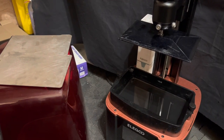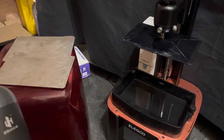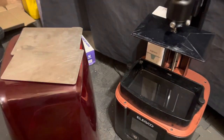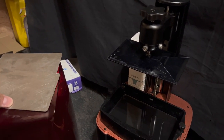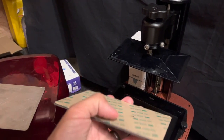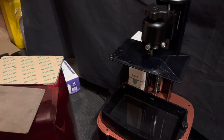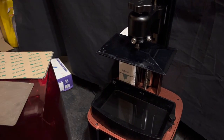I really didn't get on with the water washable resin at all — it was very brittle and there were a lot of print failures. I'm currently trying some new Conjure resins that I've been sent and they look promising, so I'll do a review video on that. I may give the flexible plates another try, but I think the problem is if you get anything between the magnet and the plate, the level is off and things won't stick to the bed properly.